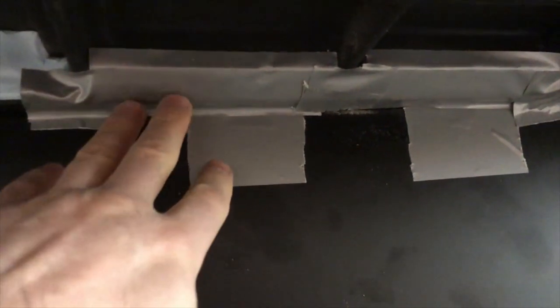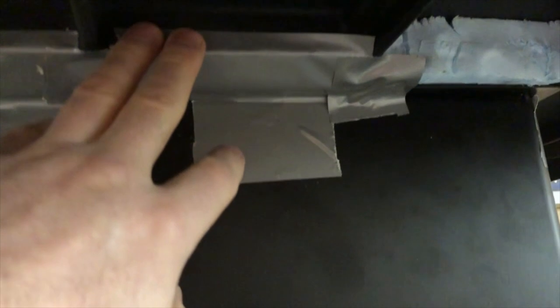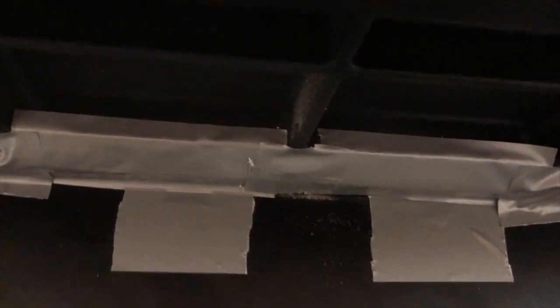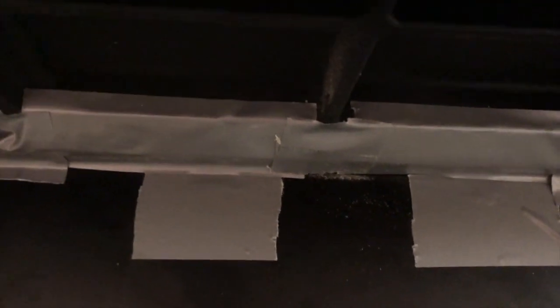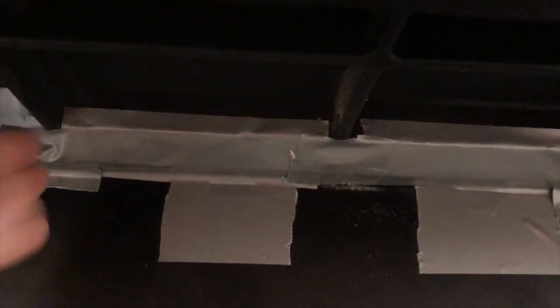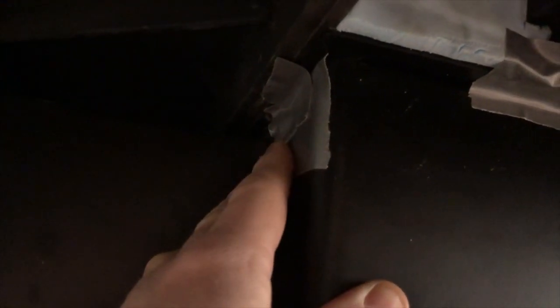It is sufficient though. There are massive holes in between the cabinet and the cast iron tabletop. I've had to fill them with a combination of foam and duct tape here. And I know there's a lot of work to make a new model for casting the top, but this they really should have done something about. Here you can see where the bolts fixing the cast iron top to the cabinet are located, and there's huge holes here as well, but these are easily filled with just some tape.